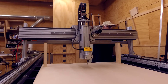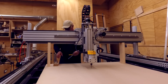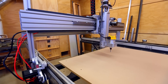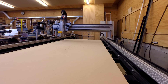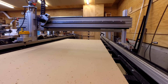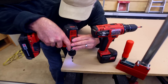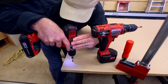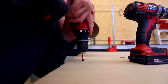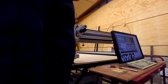Once the first layer of the table was in, I could get the gantry parallel to the table — I wanted to lower it just a little bit since it didn't need to be as high. I wanted to screw the MDF to the frame with the screws set below the top surface, so I drilled holes with the router to sink those screws. G-code is the code that runs the motors, generated by software when you send it a drawing or shape. I'd heard it was really simple, did a little research, and yes, it's really simple. I wrote a few lines of G-code to have the router drill three holes across the surface of the table, and it actually worked — it was amazing.